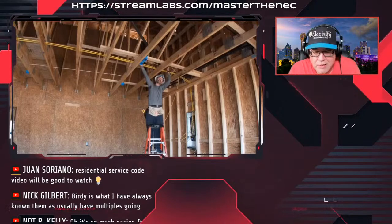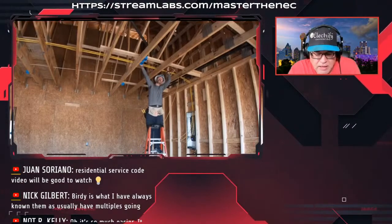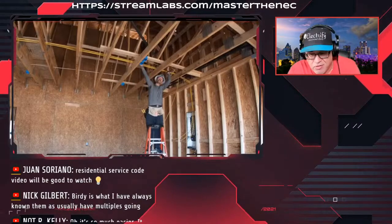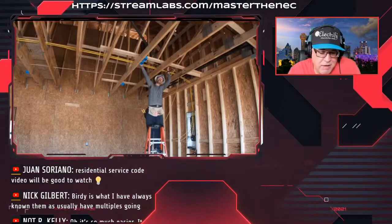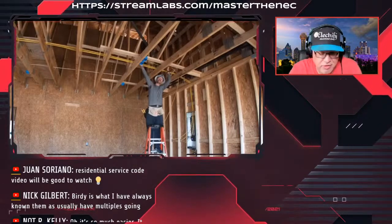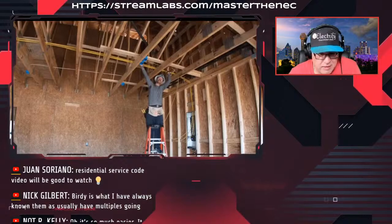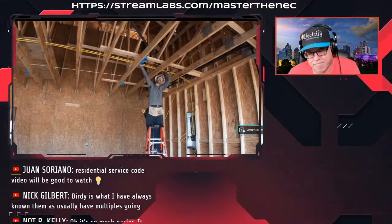So he's doing it. The other thing that you've got to worry about is it's very clear in the code what can and can't be on a small appliance branch circuit. Okay, so it's to serve receptacles and things like that. Yes, the microwave is a receptacle, but obviously he's done many of these, so he's not having any problem in the jurisdiction that he's in. So that's just what he's doing. Again, some places would have a serious issue with that.